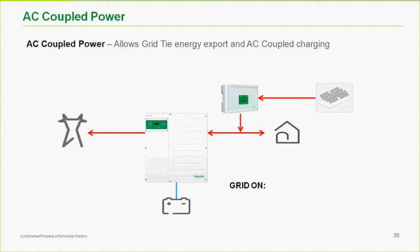So if I was going to AC couple a 30 kilowatt array to a system that had a 5 kW load requirement, I would have to have 6 XW pluses as well as 30 kilowatts of grid tie inverter. Very costly system. If I did it DC coupled, I could tie a single XW plus to a large battery bank, and it would be a large battery bank either way, with 30K of charge controllers and be just fine. In cases like that, you run into a bottleneck because all the charging capacity of the array has to go through the battery-based inverter. So if you have continuous loads 24 hours a day and a large array requirement, it is considerably cheaper to do a DC coupled system.